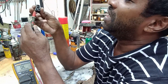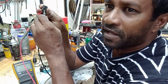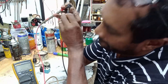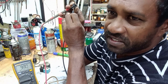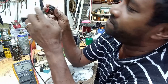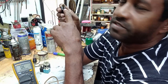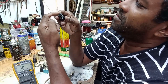So I set the multimeter to ohms and put it across the two small pins — and there I have 98.1 ohms, let's say 98 ohms. Now let's try the other two — and there you see: open circuit. So we can confirm these two small pins belong to the coil, and when these two pins are energized, current flows across the contacts.